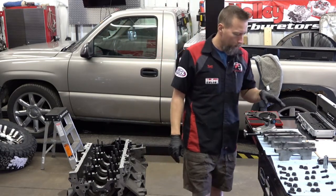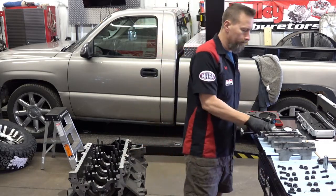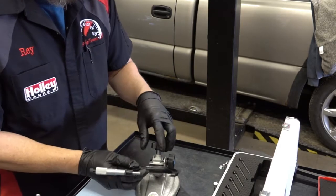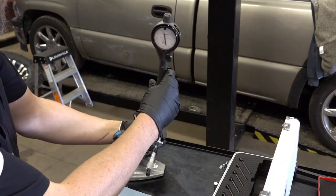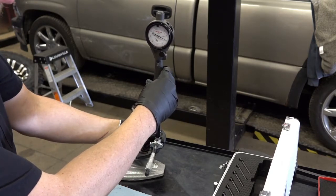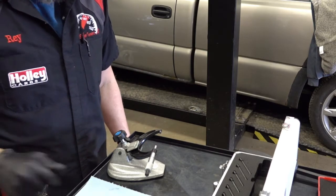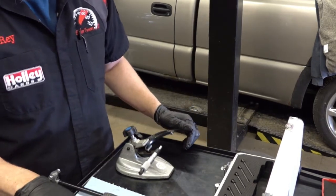The first step we have to do is clean out the cutting fluid from our bores. Then the next step is we'll set up our micrometer and dial bore gauge. The dial bore gauge is what we actually use to check our measurements. I've got our micrometer set to 2 inches 559 thousandths. I'm going to put it in our fixture and get the dial bore gauge set to zero.